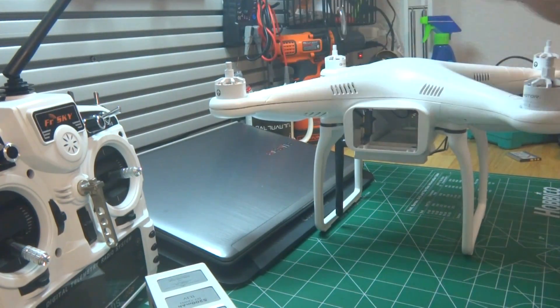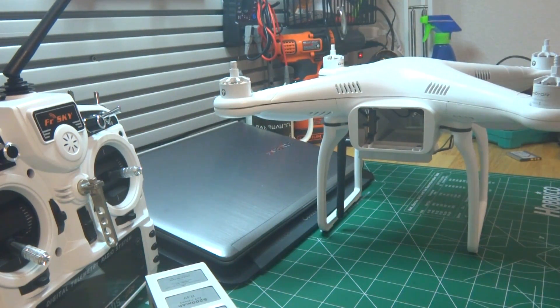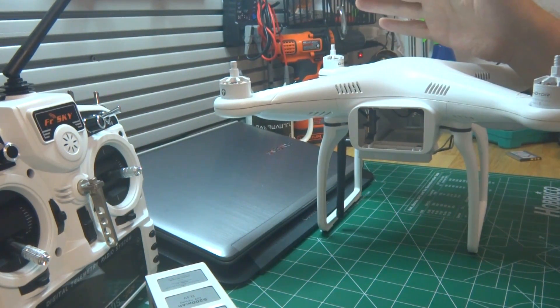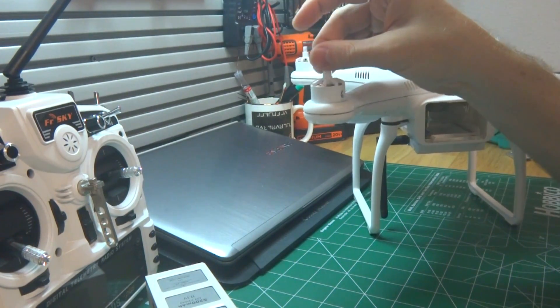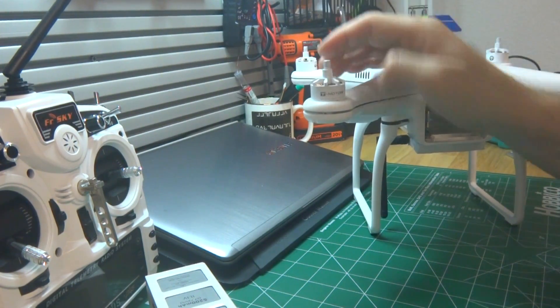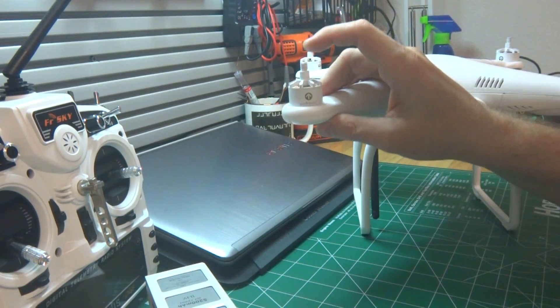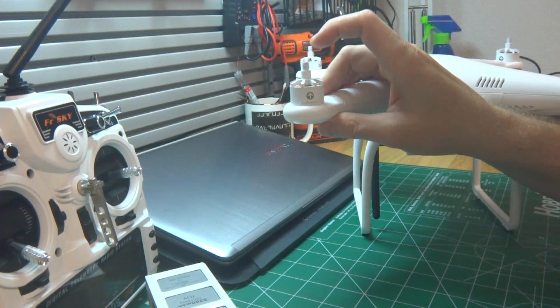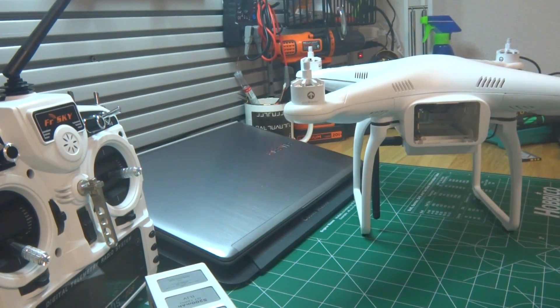To get this going, you need to buy a replacement shell kit — the upper and lower shell — plus a set of legs, the power distribution cable, and a screw kit. You'll definitely need a spare screw kit because the replacement shell kit strangely does not include all the screws needed. For motors, I was going to go with the DJI OEM motors, but I scored a set of T-Motors — the anti-gravity upgrades sold for Phantom users. They offer a couple of percentage points more efficiency than OEM, but if you can't get them for $75, just go with the DJI motors. They're pretty good and you won't notice much difference.